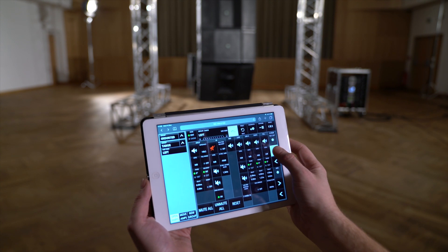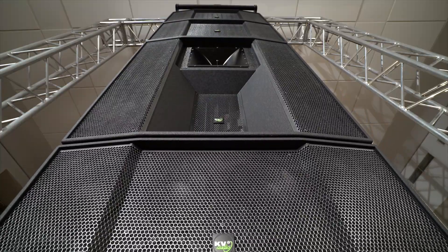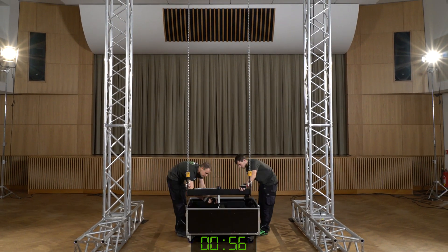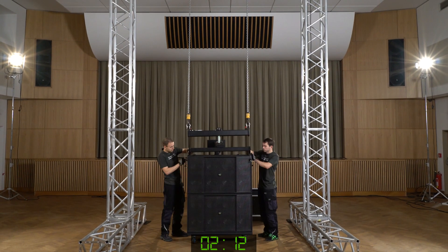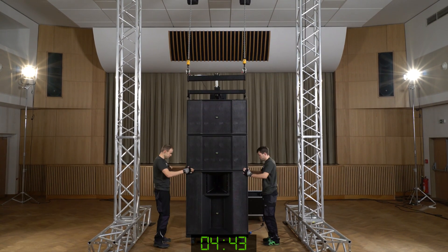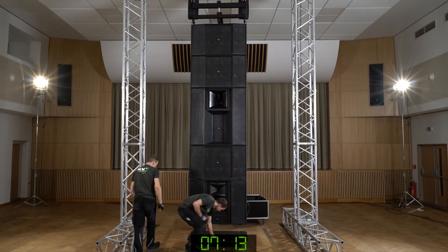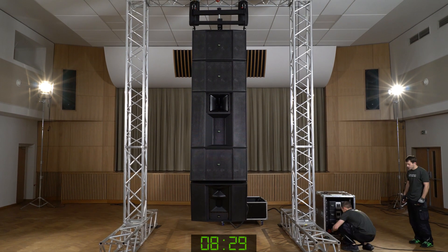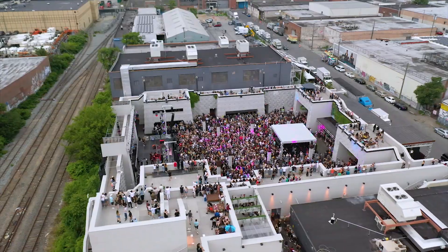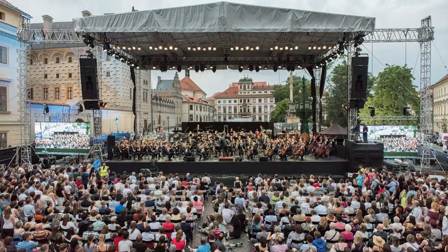This unique design ensures that as long as the system is carefully placed and aimed correctly, the sound will be extremely even and linear within the entire listening area out to beyond 100 metres. The ability to move and focus this sound delivery is a revolutionary concept whereby even once the system has been flown, it can still be individually tailored to a changing situation with different audience sizes and areas. Unlike multi-arrayable systems, as a point source solution the VHD 5 does not require complex software to recalculate new cabinet angles or several hours of manual reconfiguration by a team of system engineers. This means that noise problems or environmental changes can be dealt with in a matter of minutes and at the touch of a button.